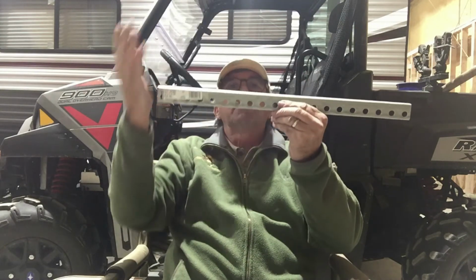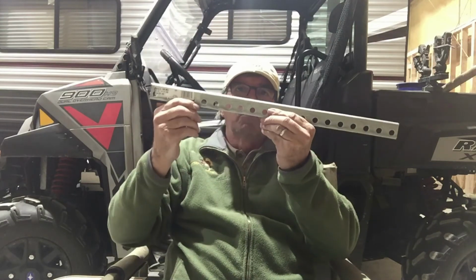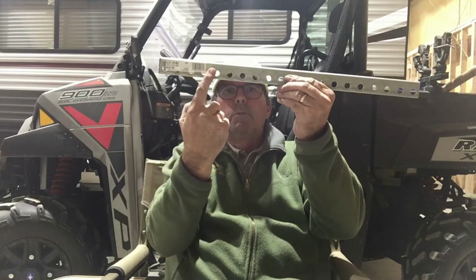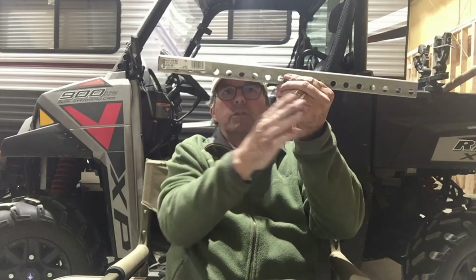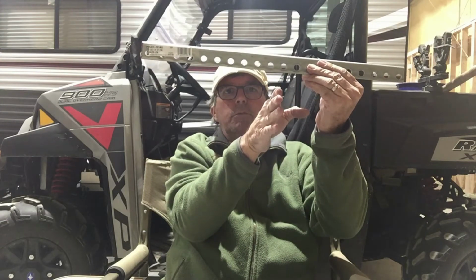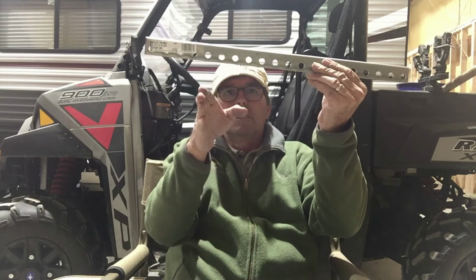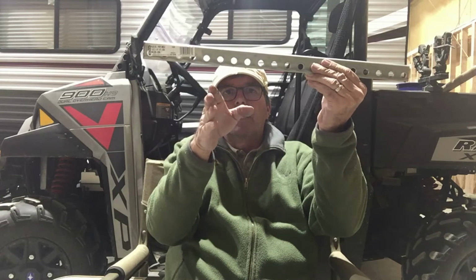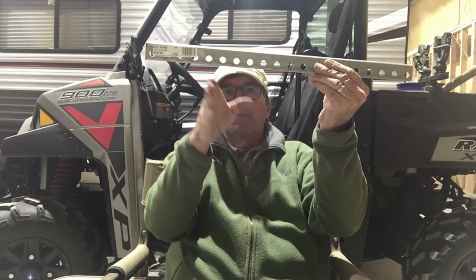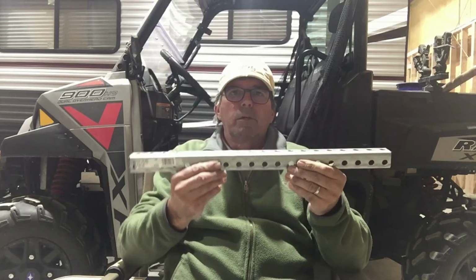Purlins, I'm looking up high here, are probably 6 feet apart. So we took a 6-foot piece, hung it there, and we were able to move that chain wherever we wanted to. So let's say we had the tube over here, and we thought we were close to between our two ribs. We can move that chain and move that whole tube section, and I'll give you a shot of that in a minute, the completed product. But anyway, we were able to move that over and get a center between those two ribs. So it worked out pretty well.